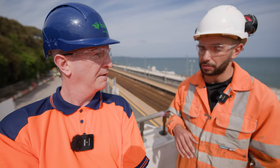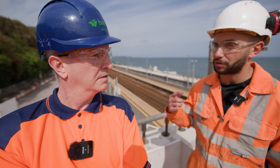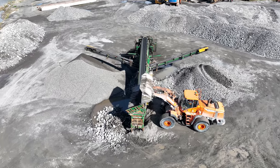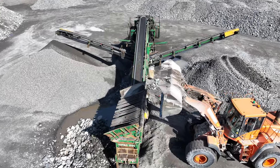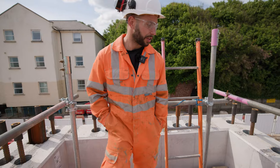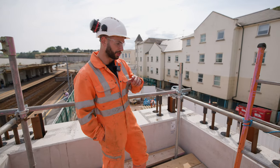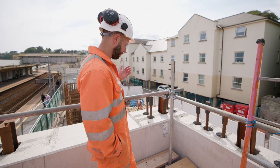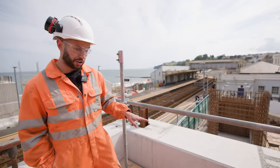Today on the progress tour we're going to be looking at some of the precast sections that we've installed. The latest video we've done is the manufacturing process over in Ireland — if you haven't watched it, please click the link above. We've got part two coming in the next couple of weeks. Behind us there are 40mm grouted bars all around the perimeter of the wall — in total about 27 bars — which basically go right down into the foundation and all the way up the structure to the top.